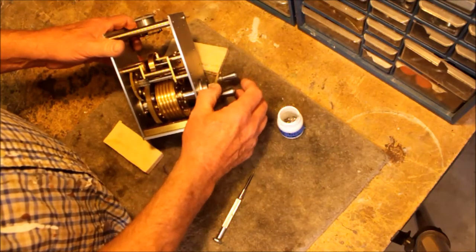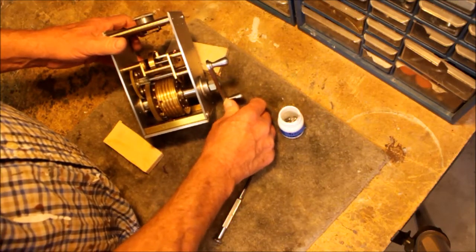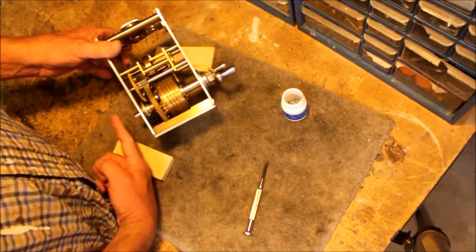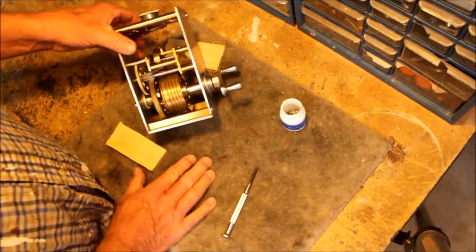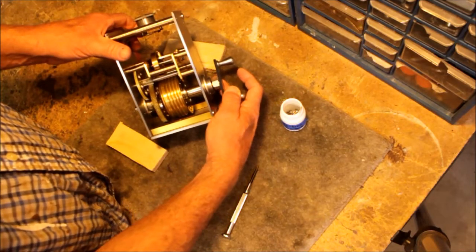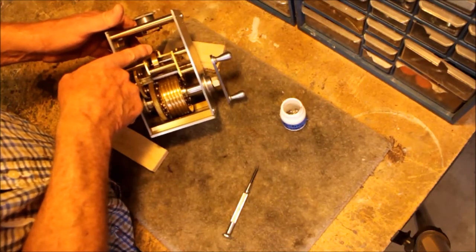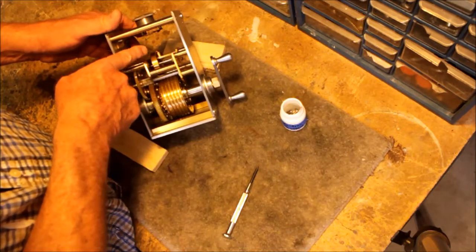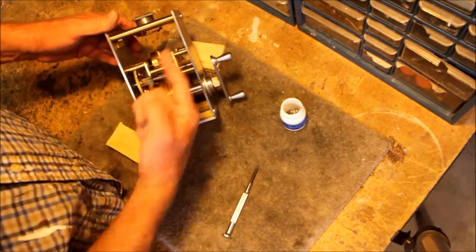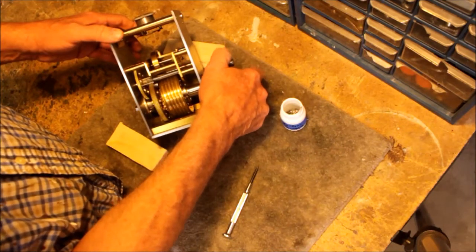And you can see that the gear train here has the effect of simply acting as an escapement to slow this down. This here would connect essentially to the telescope, so it's going to have to turn at some fairly slow RPM, much slower than I'm turning it here. And this mechanism has the purpose of governing how slowly that turns. This is called a crown gear, and there's a pinion there hooked to the governor, and that governor spins, and you can change the rate at which that governor spins through the friction device here.